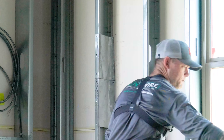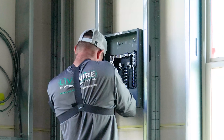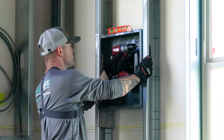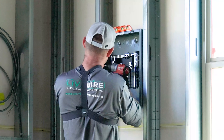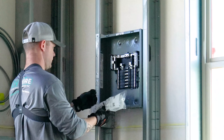The next thing I did was install the panel. I got this small 12-circuit panel — it's a 125-amp main lug. I like to put the tops of my panels at six feet. I know it's not going to be too high for most people and not too low. When I'm working on it right in front of me with the top at six feet, it's just a personal preference.